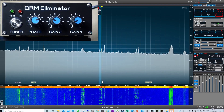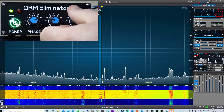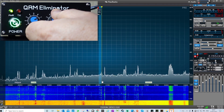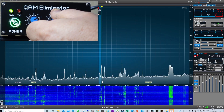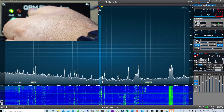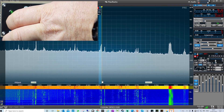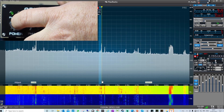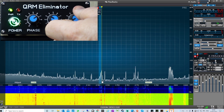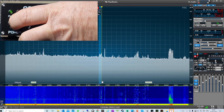Watch this. Okay, so that's off — that's before I bought the box. And that's on. Now, you could argue that all I've done is attenuate the signal down, and yeah, I agree with that. It's gone down from sort of an S9 to an S4 or 5. But I do feel that the audio against the noise is a lot clearer. When you turn the box off, the signal increases by a magnitude of maybe 20, and also the strength of the received station increases. But I think it's a lot nicer to listen to.